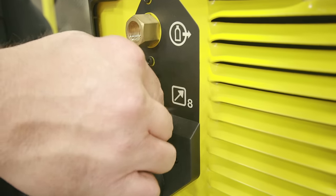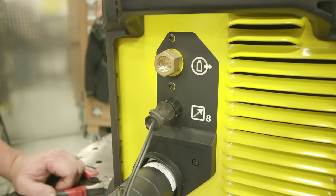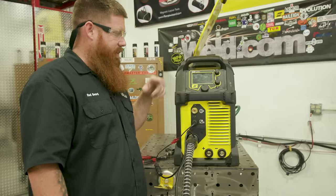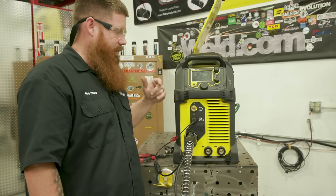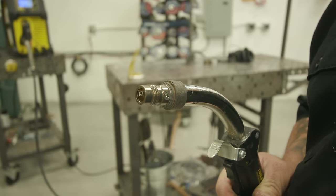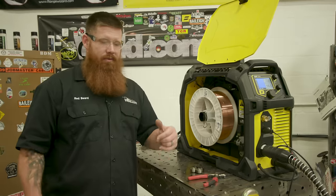Plug in the Amphenol connector. The separate gas point is for gas tungsten arc welding or TIG, because it operates on a different solenoid than the MIG torch. On this specific model you can hook up a foot pedal for the TIG solenoid. Make sure you have the right gas port plugged in at the back — that goes to your drive roll assembly so when you pull the trigger it engages the gas solenoid for the MIG valve.